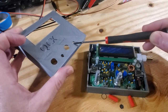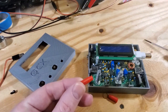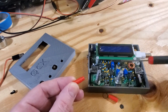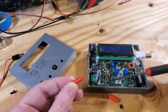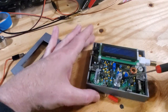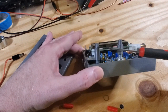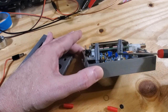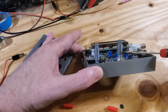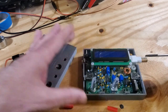There are two cutouts for the buttons themselves. Also part of the models are two pieces that go between the top of the case and the button. And finally there are shaft extensions that go on top of the encoder and the volume pot. This one's a press fit. I tried a press fit with the other one but it just wouldn't work — it would move around — so I drilled a little hole and put an M2.5 set screw in there.